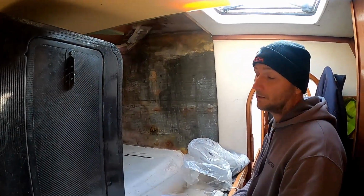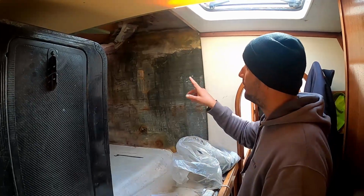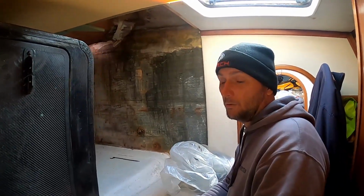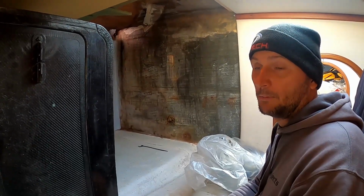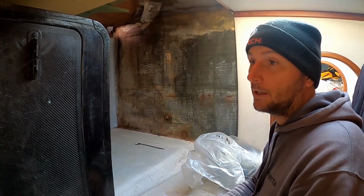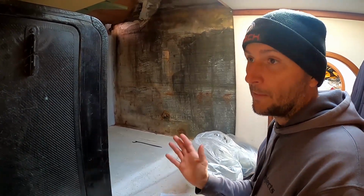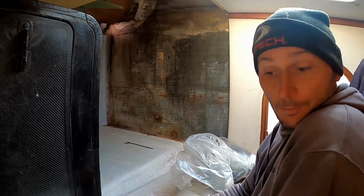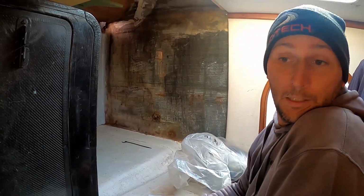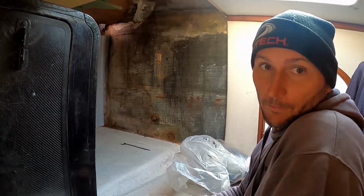So I'm mounting the Clark pump for the Watermaker up on the bulkhead here. I need to glue some carbon plates on there, which I'll tap and put thread certs into, so that I'm not actually bolting through the bulkhead. I'm actually just hanging off the inside skin. But while I'm at it, I'm going to fix the problem of the aluminium washers for the fuel tank that are fizzing away.